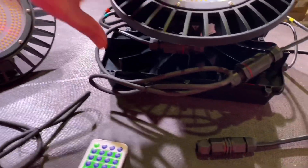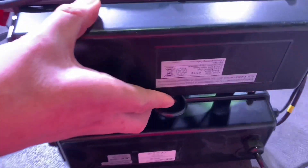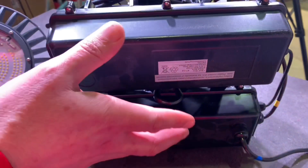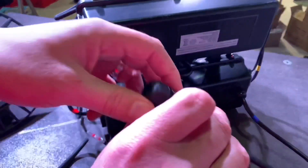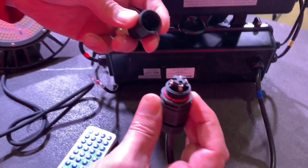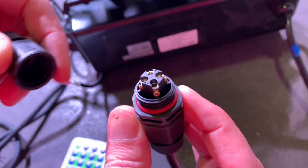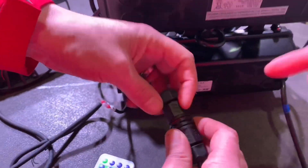Here's the emergency option. On the back you've got the battery pack itself — it's all pre-wired together. If you had the occupancy sensor, that would be pre-wired as well. You just make a simple connection using this IP-rated connector — unscrew the barrel and you've got your four connections: permanent live, switch live, neutral, and CPC.